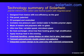It's a direct flow system, so you get high stratification of hot water at the top. Backup heat is applied in the evening. In terms of handling overheating, the pump is always on to give heat export. This is very different from conventional solar where the pump is switched off. The glazing is twin-wall polycarbonate — non-selective and double glazed. It's non-selective because we want to be able to dump heat by radiation. It's an integrated design, where the panel is designed only to be used with Solar Twin components and only as a system where the pump is continually run when there are high temperatures.